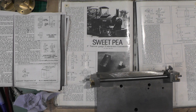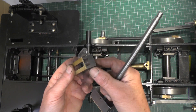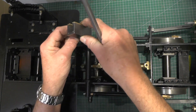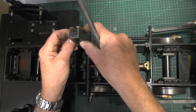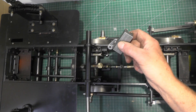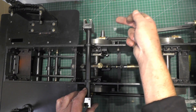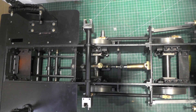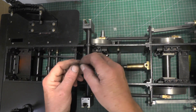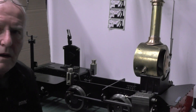I also forgot to mention I've made this right angle bracket that bolts on with two bolts to the side of the slide, and that's to attach to the forward and reverse lever to give you your different angles for your different gears and your forward or reverse. So all that's going to happen here is this is going to fit into this way shaft assembly, and then I've got to put this on this end and knock the roll pin in — that's going to lock them exactly parallel.